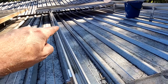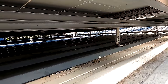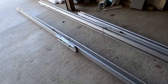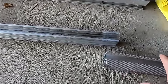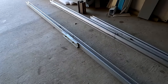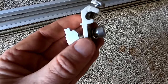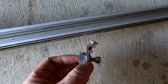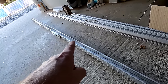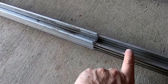We need one earth or ground point per rail system if we don't have any joints. But here I've got a rail system which has one and two joints. This is the whole length I need and I don't have it in one piece anymore, so I have to Frankenstein this together. The regulation says we need one of these earth lugs per rail system even if they are joined, but only if the joint is from the manufacturer of the rail system. If you use anything else, you need an earth bridge across your joint.